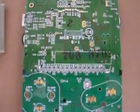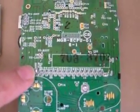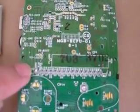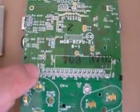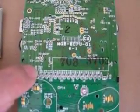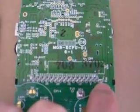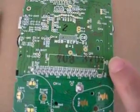Let me get a close-up on the main board here. If you look at your Game Boy Pocket main board, you'll see this last pin here — it's designated as ground. You would solder the ground of the backlight to this one, and you would solder the positive to this one here, the VDD. There's also another alternate point up here labeled VDD.